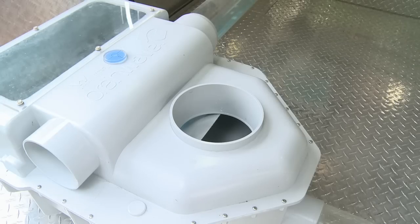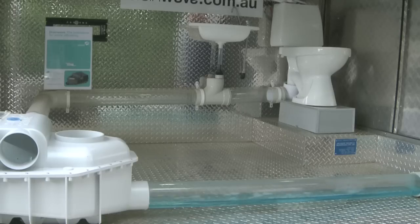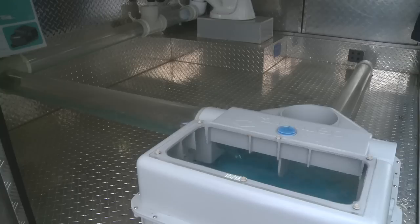As you can see in the pipes, the water is collecting steadily into the Drainwave and once there's enough there to activate the bucket, this being 10 litres, the bucket activates and allows a double wave to go down the pipes and clear solids which may be built up and to carry solids which are in the Drainwave more than 40 metres. We see again the action of the bucket tipping through the top of a clear Drainwave which is used for a demonstration.